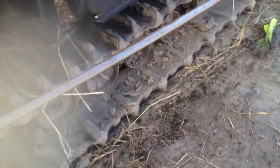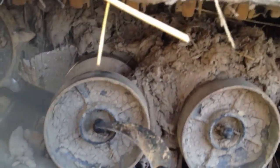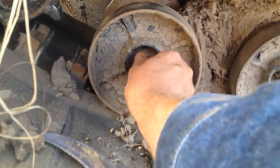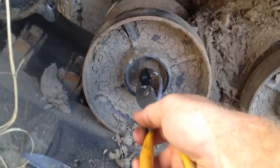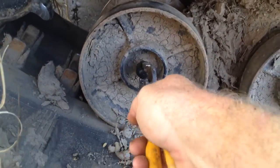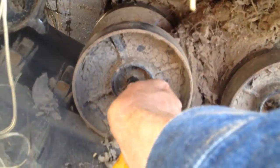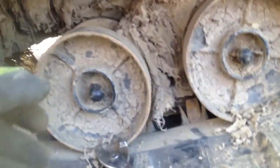Once you've done that, then you can start greasing up. And one of the most important things to grease up is the track. Now, these, you gotta put 15 squirts, and these are caps. Use a pair of pliers just to pull off the cap, right? And you put 15 in there. And let's stick it back on. Kind of hard. There you go, this pops on there.